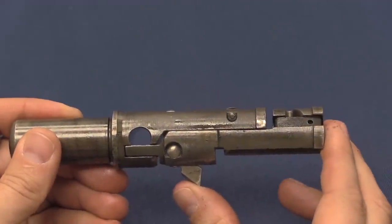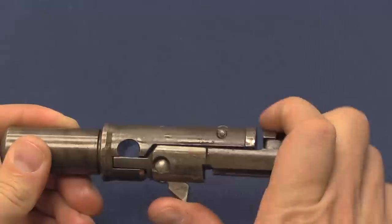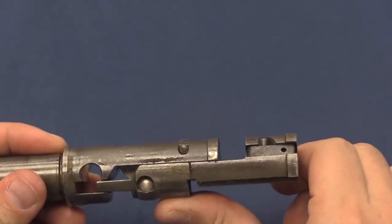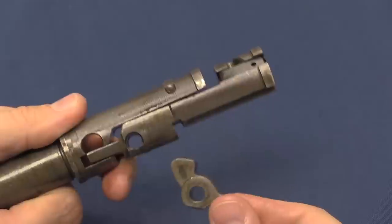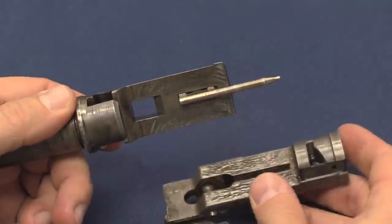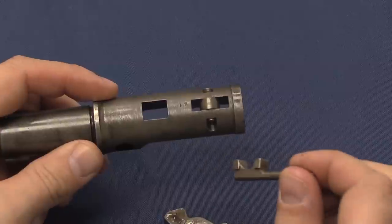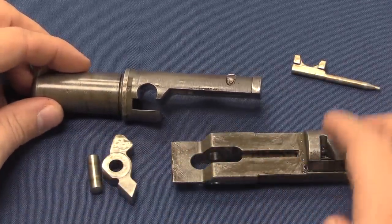We have another example of this type of bolt here from a submachine gun. Instead of having a bolt carrier, so to speak, on this design, there is simply an additional weight on the rear half of the bolt. Once again, it is put together with an accelerator lever, a fulcrum lever, with a short arm into the receiver and a longer arm into the rear half of the bolt. This effectively magnifies the weight of the rear part of the bolt, allowing the system to operate safely with less weight than would be required for a strict blowback system.